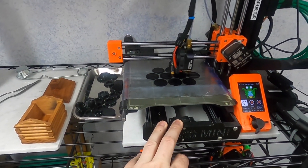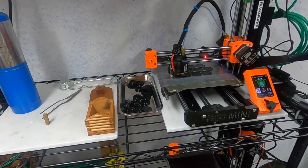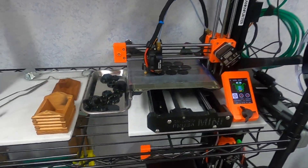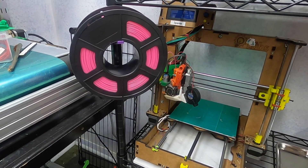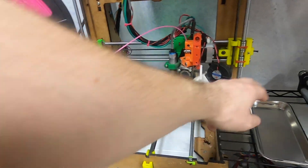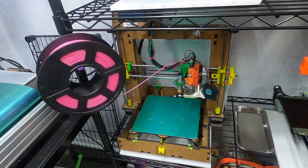Fire safety starts with safe printers. There are redundant safeties in the hardware and firmware that guard against adverse thermal events. Keep your firmware updated and make sure your thermal watchdogs are in place. Even my older machines — this is a homemade i3, yes the MDF frame is flammable — but good wire management and well-rated power supplies help. Running this at 24 volts to reduce the load on the bed and heaters, and keeping good fuses in place that are rated for the load they can draw.